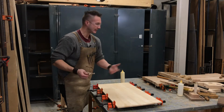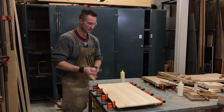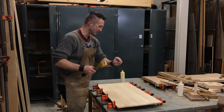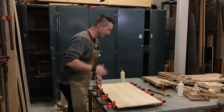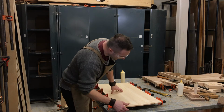then really quickly with the glue scraper in an hour, Aaron's going to pull this out of clamps. We're just going to zip over the back side with a glue scraper and knock all those tiny little beads off. And then we can go to the thickness sander. And that's going to be in the next video. Just a couple of quick tips though around glue up.